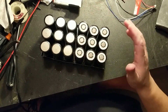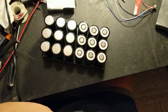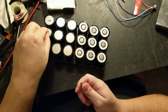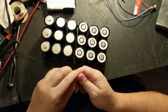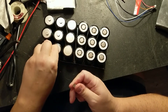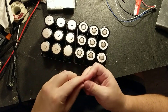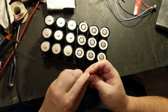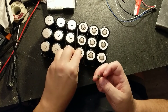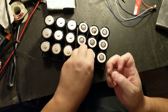In the meantime, I'm just showing how quickly you can hook a battery up. So we need more magnets — I'm going to put magnets on this. I'm facing all of these the same direction, so that the next layer — you'll see what I'm talking about. Basically, if the magnets are the wrong direction with this center connection piece, the next layer of magnets will also try to push to the side because they'll repel each other even through the sheet metal.